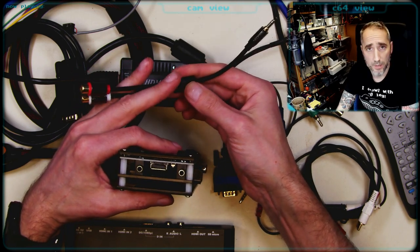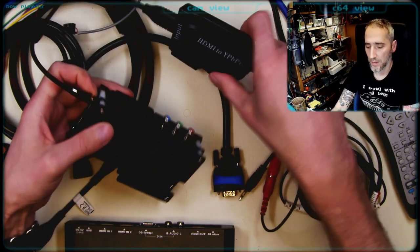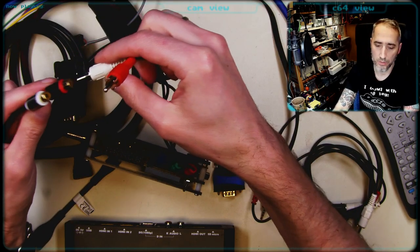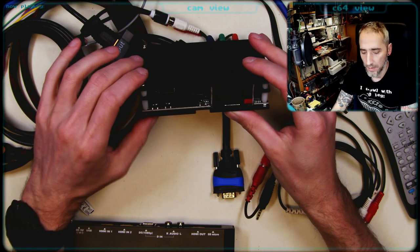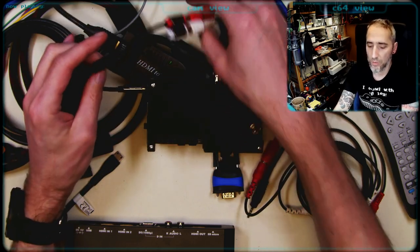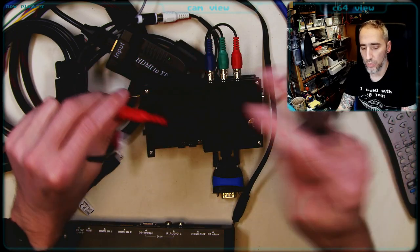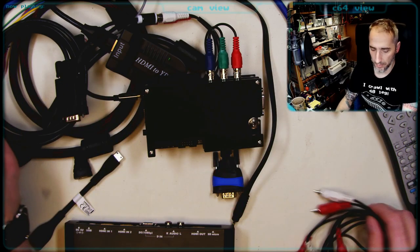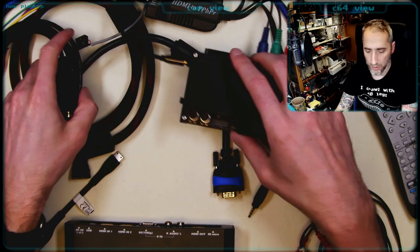And I'm really keen on having short adapters, because as you can see, the cable mass is just growing by itself. And then you have the chance to connect this converter to your OSSC in a way that looks basically like this. And audio on this. And one remark, the OSSC is basically not capable of mixing a one channel audio signal to a two channel audio output signal. So if you have just one audio feed in, then you will have the audio just on one side. So basically you have to come back to a cable like this that makes one audio signal into two audio connectors, and therefore it becomes a bit more messy on your desk or shelf or whatever. So much about signal conversion.